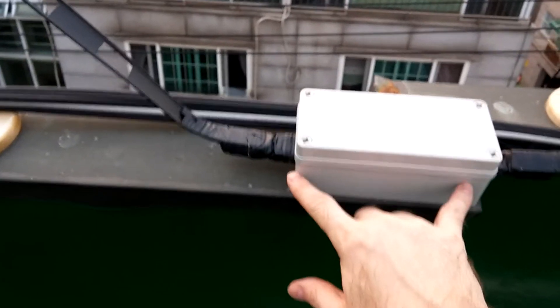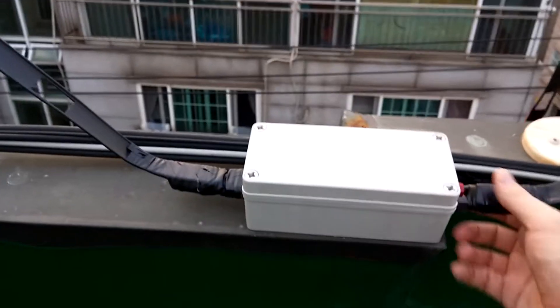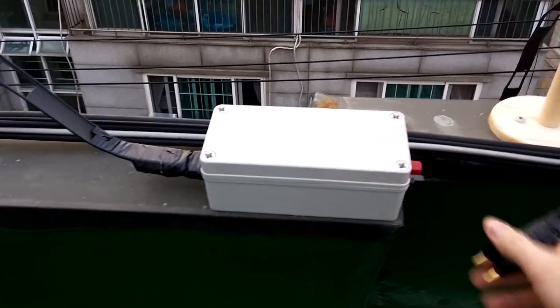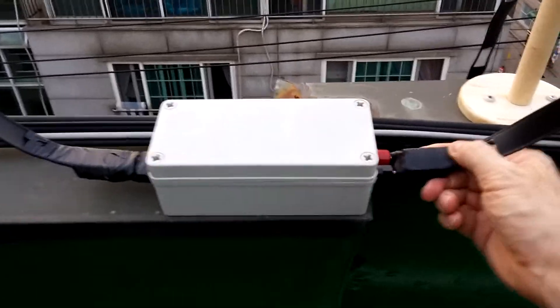Raising the ladder line up a foot — this disconnect is just a short distance here, close down. It does make a little bit of a difference in my SWR, but it's not a lot and seems to do fine. Anyway, I disconnect that before rain, just to be safe.